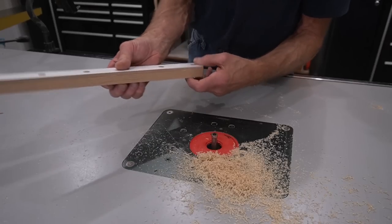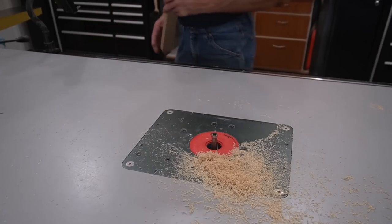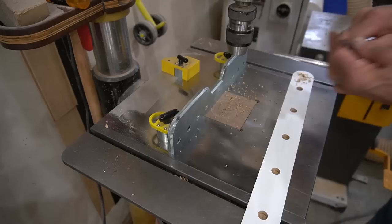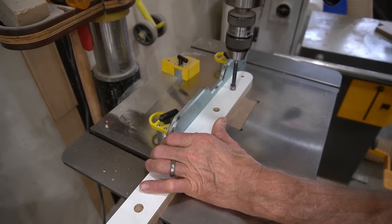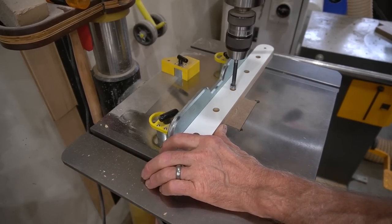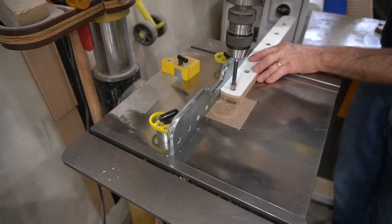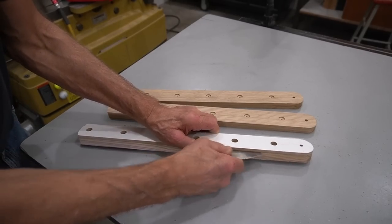This approach is much quicker, more straightforward, and simpler compared to cutting pieces individually and shaping each to a pencil line with a drum or disc sander. Once flush trimmed, I hop back to the drill press and use the template to locate holes for rods and pivots: a quarter-inch brad point bit for the pivot hole all the way through, then a half-inch Forstner bit to locate the rod holes at approximate depth. I use the depth stop to re-drill the half-inch holes to a consistent depth on all the arms, and it's quick and very accurate using this template.